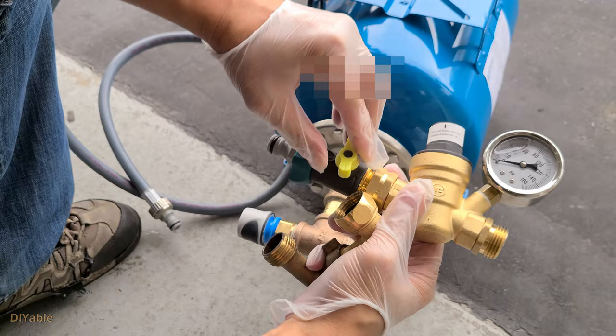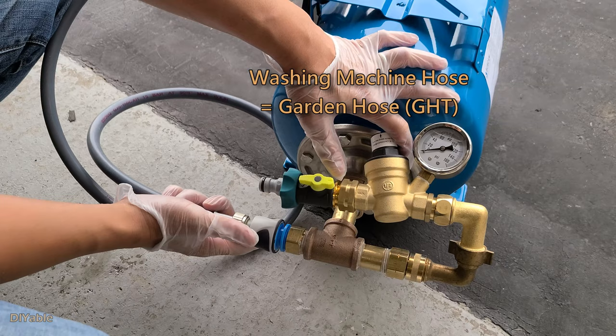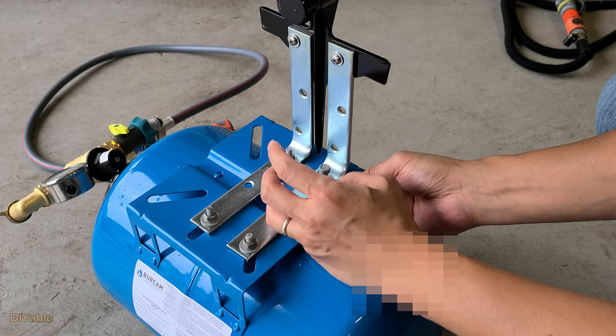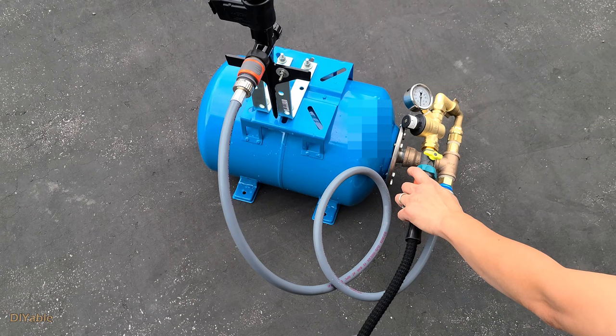No more leaking. I added a garden hose, shut-off valve, and quick-connect fittings to make life easier. I also have two 90-degree angle fittings because they take up less space and make the project more elegant. This gray hose I took from my old washing machine — the fittings are GHT. Never throw away old washing machine hose; you can reuse it in the garden. This connects to the motion-activated water sprinkler. To secure the sprinkler to the tank, I'm using galvanized and stainless steel nuts and screws. Looking very good — I think the raccoons should be very scared.